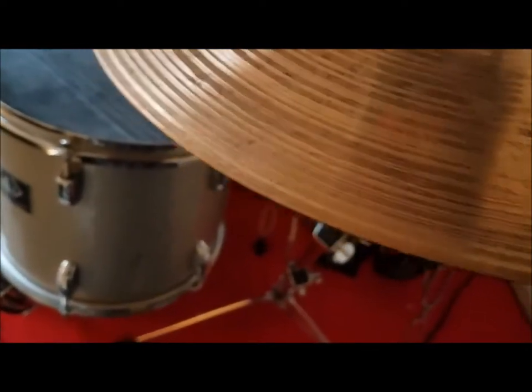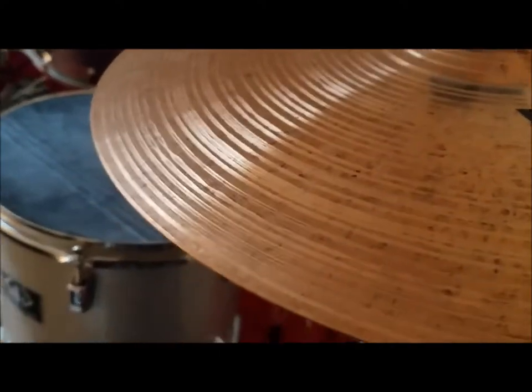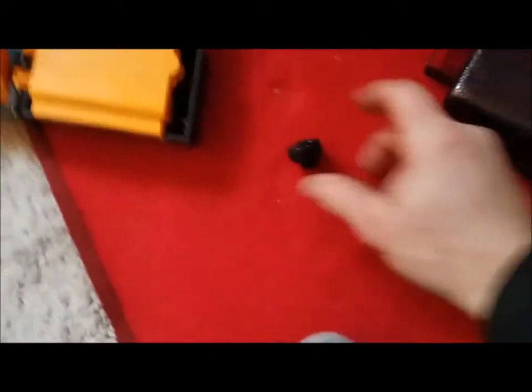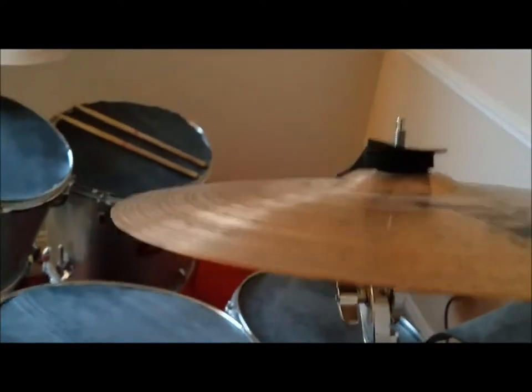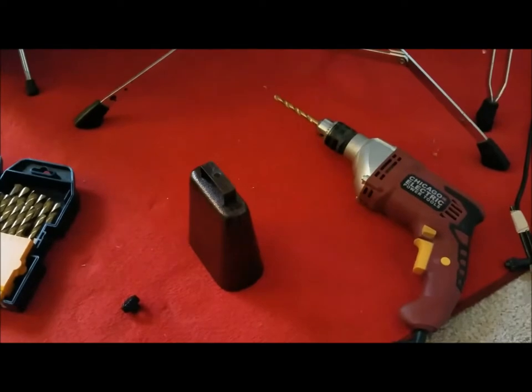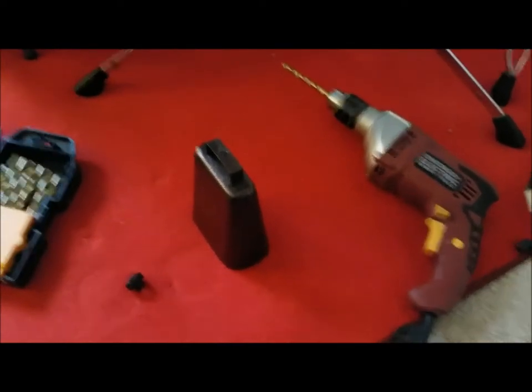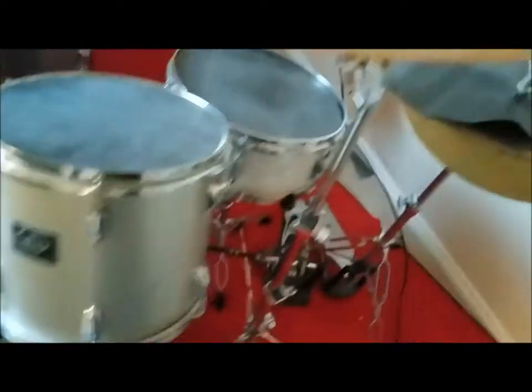Oh, we got it — this might even thread on here. It's a little bit too small. I measured to the inside diameter and not to the threads — so make sure you're measuring to the threads. We're going to go one size bigger. Just for your information, this ended up being a 5/16ths hole, and I used an 11/64ths pilot hole, which is just a smaller hole if you don't know your measurements.